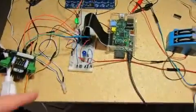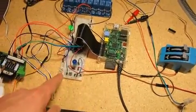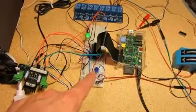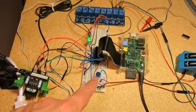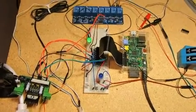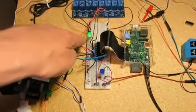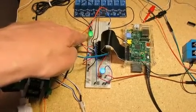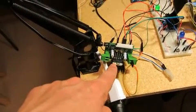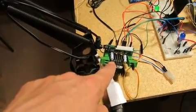Here's how we're doing it. This is a Raspberry Pi. It's got its IOs going to this breadboard. This LED right here lights up whenever the light is blocked on the photo sensor — that's what the program uses to tell that it blocked that path. This LED right here is indicating we've got power to the track, so the train should be moving. Then we've got our motor driver right here. This is normally used to drive wheels on a robot, but we're using it to drive the power on the track.